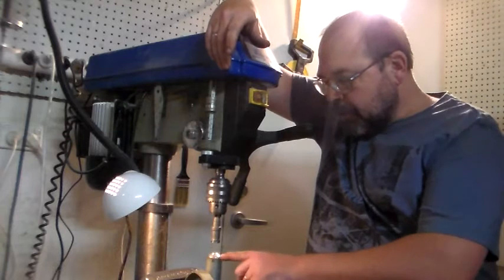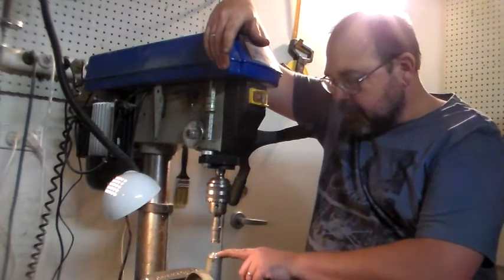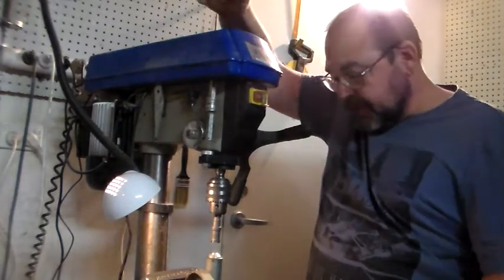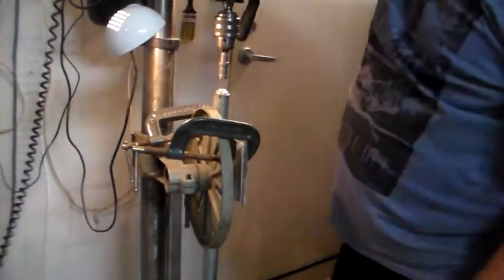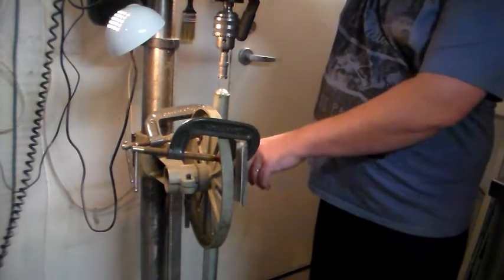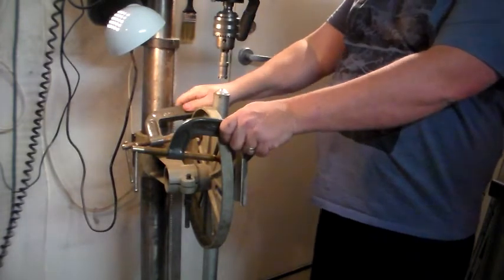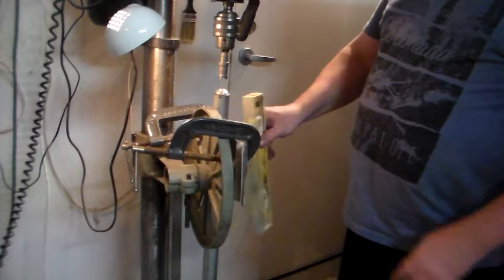I'm thinking the conical shape maybe isn't the best, so I had an idea. What I've set up here on the drill press took me forever to get measured up and level, and I'm assuming it's okay. Basically, what I've done is turned the table on its side, taken my cross-slide vice off, and I'm using the top plate off a bike carrier to hold this bar in place on the table. I've got two G clamps holding it on, and I've used a spirit level to make sure it's level both ways.